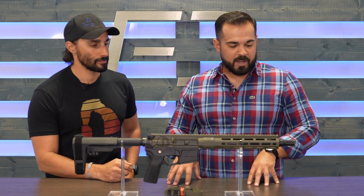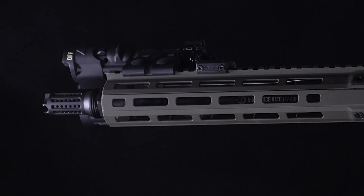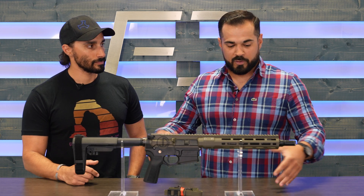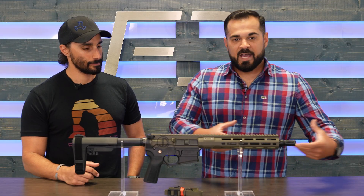Let's start from the front all the way to the back. Right at the front you see our signature RCB muzzle device. This one is the HX version, which is a perfect host for the Huxworks line of suppressors. Obviously Duffy has been using those for a while. The lack of gas pushback towards a shooter is a huge performance adder versus conventional suppressors. Plus they're very, very quiet.